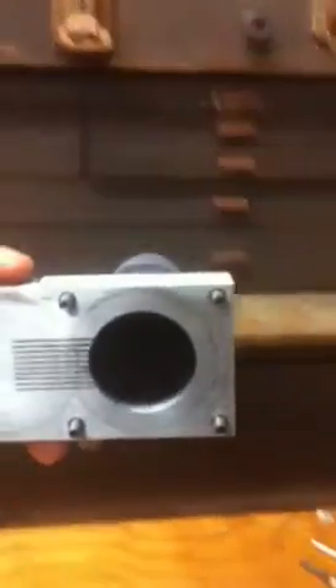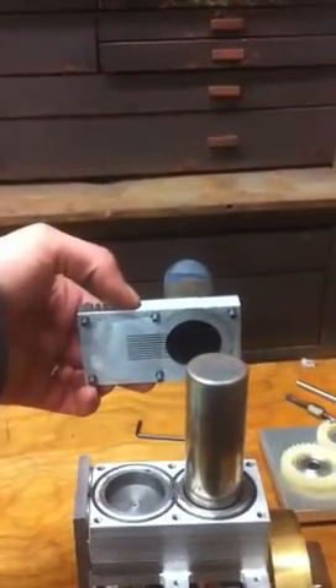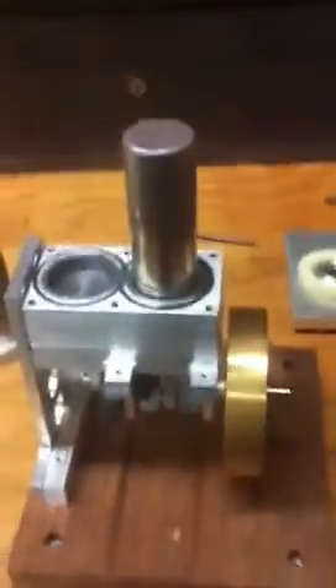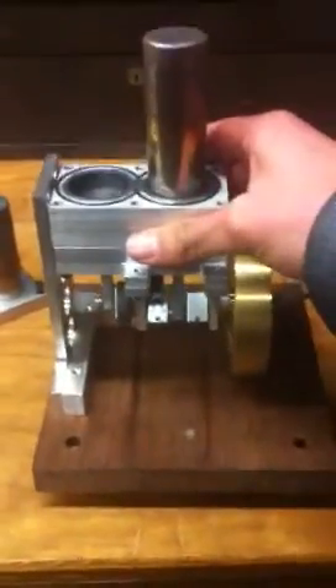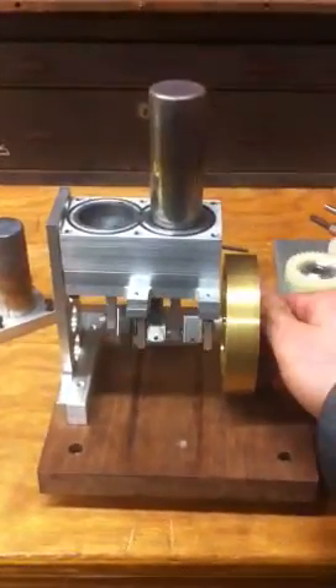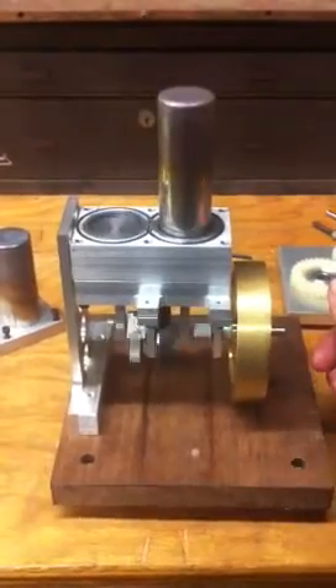The clearance between the piston dome and the hot cap is about twenty-five thousandths to a side. It's mounted on springs to take up the residual vibration that couldn't be balanced out without a counterbalance shaft, but at higher revs it runs pretty smooth.